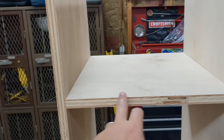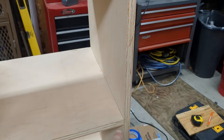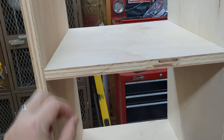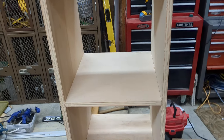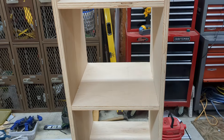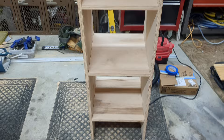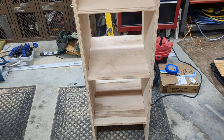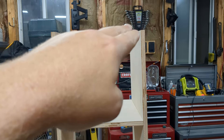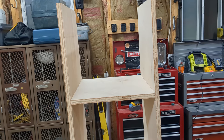These are 14 and a quarter inches, and they'll be 14 and a quarter by 14 and a quarter. Once we face trim them there'll be a little overlap. Essentially making the equivalent of an Ikea cubby so we can fit lots of little storage baskets. Ended up going with five shelves — one, two, three, four, and then the base. With the way the height worked out, it'll sit on top of the butcher block and go up so I can put one going across above the door that's next to the storage area.